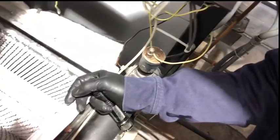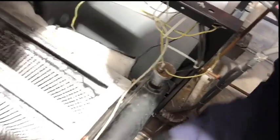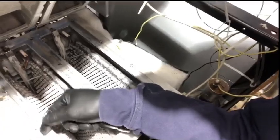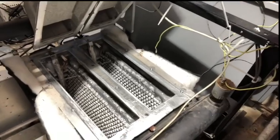That'll be the last thing I'm going to do, because I am going to be replacing them. You also have inspection on both sides of this boiler where you can get into that collector box if you never wanted to take this off and do it from a side. But there's a baffle in the bottom of this, and if you're standing behind it, the screw that releases that baffle is usually accessed on the left-hand side of it. So that's about it right now.